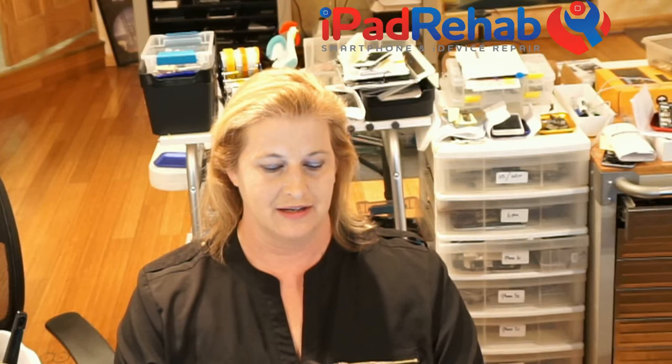And I think that the designers thought, well, we've got this E75 chip here in the cable so that the device has to recognize that this is a legitimate Apple cable. Otherwise, the software will say, accessory not supported, we don't know who you are, get out! And therefore, on the device side, we don't really need to have a lot of protection because we're already protected. We can save on all that. And it's amazing to me, I think that's likely to be true, and that it's amazing that it took like 9 seconds for China